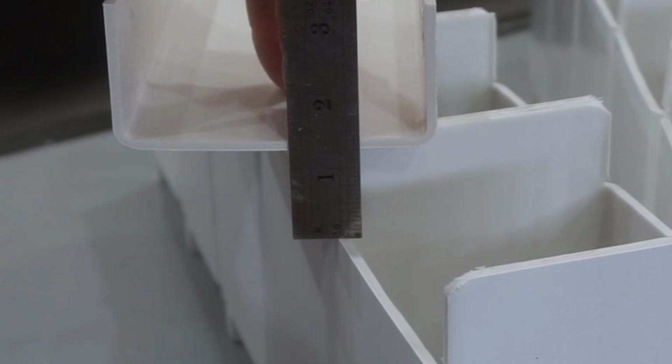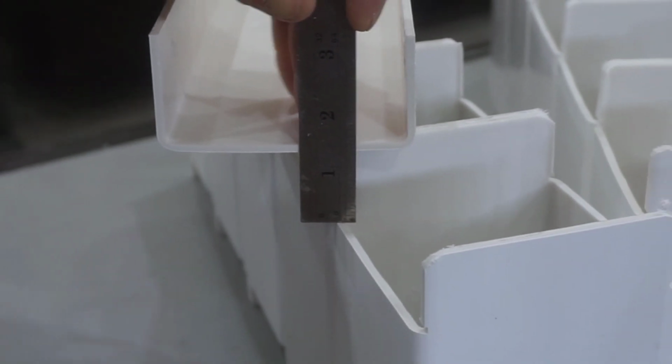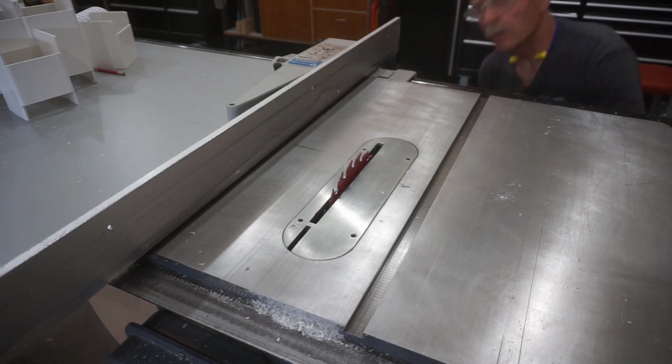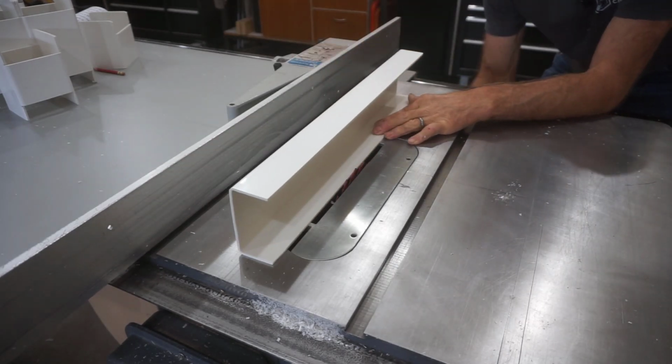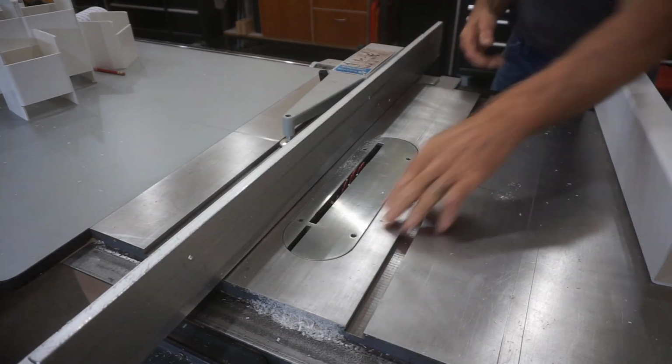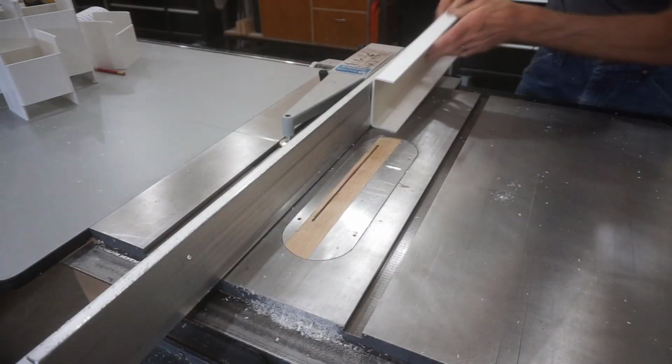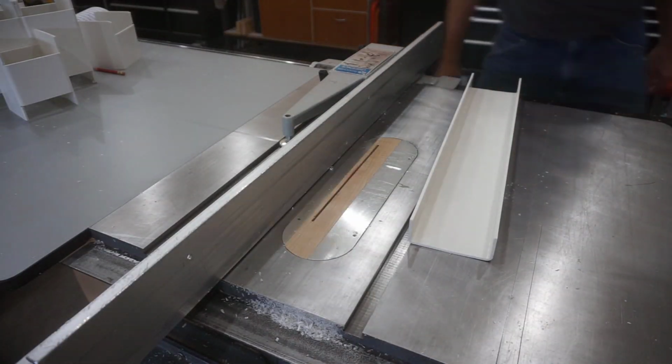So I'm going to start off on the table saw with a full 1 7/16 inches for my initial cut, see how it fits, and trim more if necessary. Remember to remove that 2-degree bevel setting you were just using for trimming the container assemblies, and then lower the blade height so it's just a little bit more than the thickness of this tube. Then set the fence and rip off both legs to that measurement we made a second ago.